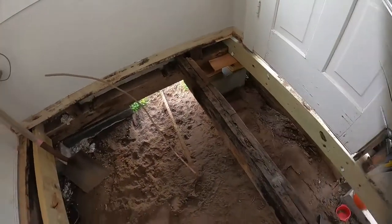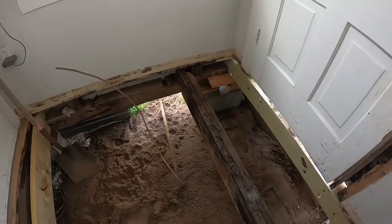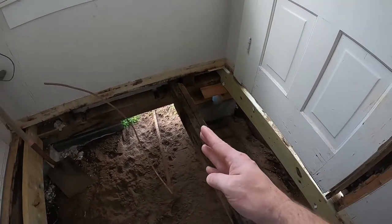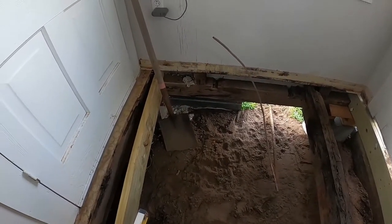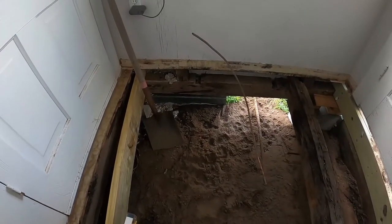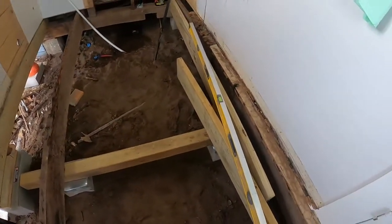So today's update: I'm going to get the floor joists in place and make sure they're in the proper location. I'll measure off the outside beam, come in 16 inches on center, and make sure I have the proper spacing all the way across. This last one will fall wherever it falls, but the mid-spans will be in the appropriate locations.